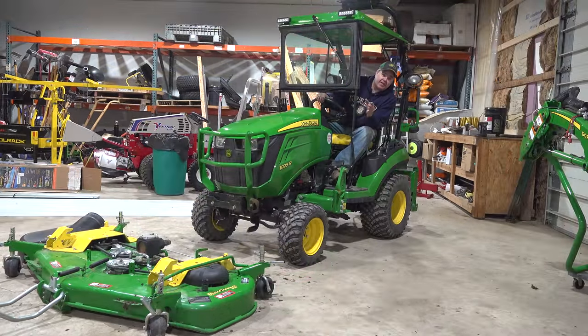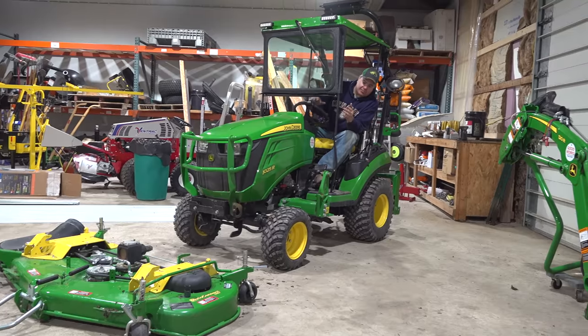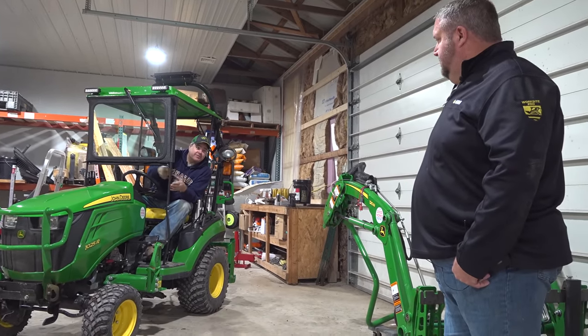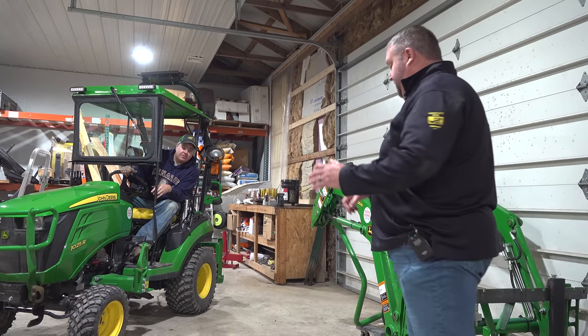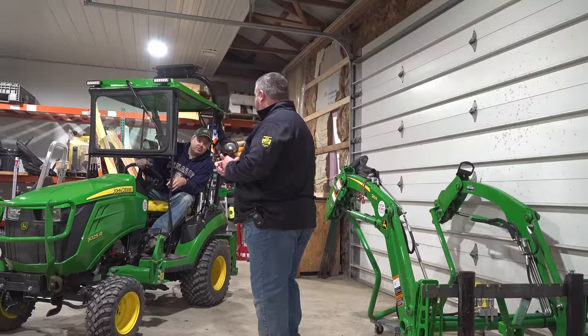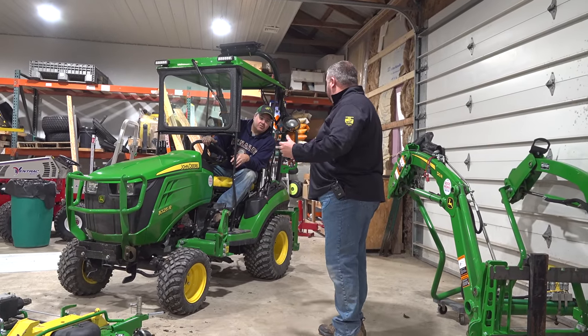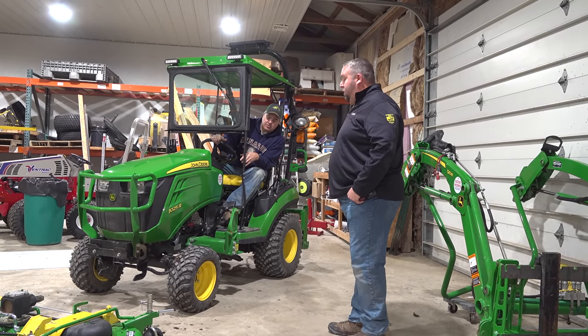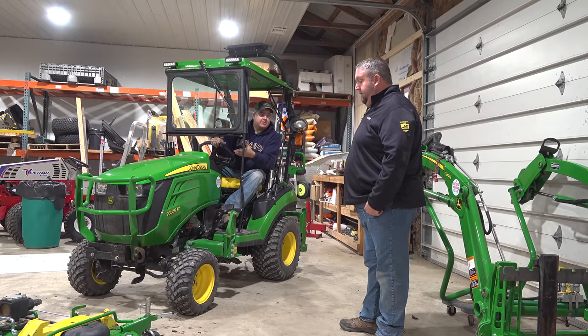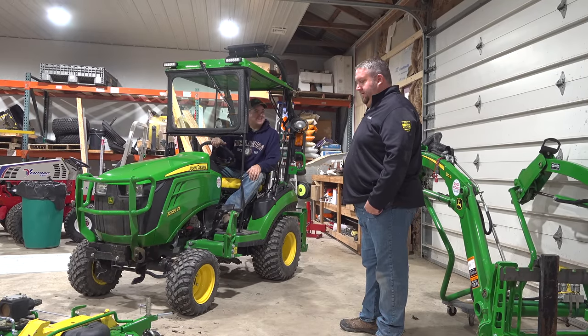Yeah, it seems to me like, Matt, that gusset concept is right there after I've hit the ground. And really it's to help that PTO shaft. Yeah, that's really your limiting factor there, is that PTO shaft. You need a little force to make those lines align if they've got out of adjustment over the time that you've been detached from the mower deck. Yeah, and it seems like I need to do maybe the same thing when I'm unhooking. Just a little bit of a gusset, as you say. Yeah, gusset. I like that.